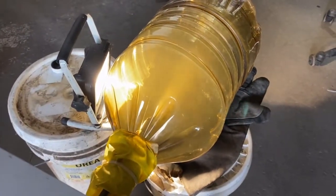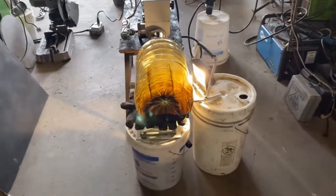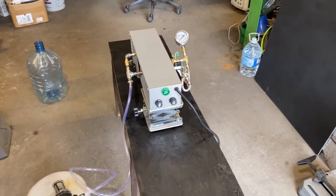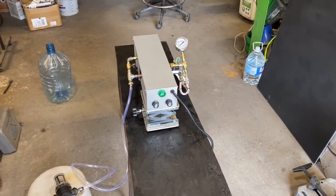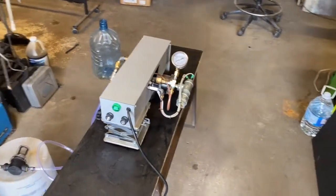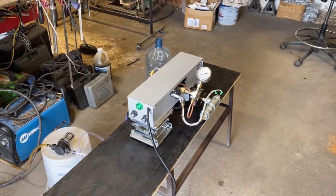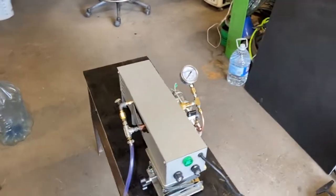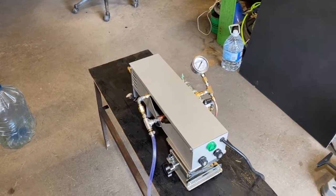We're populating a flow rate power chart today for a smelting furnace used for cast-iron casting. Doing a video for Jeremy today — they've commissioned a modular combustion system for a cast-iron smelter, and I've taken their previous equipment and turned it into this little box here. Today we're going to test out the pressure settings on a 2.5 gallon per hour, 80-degree B cone nozzle.